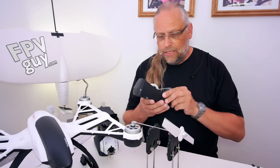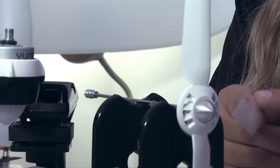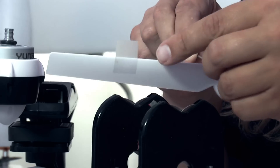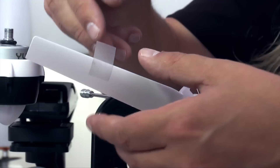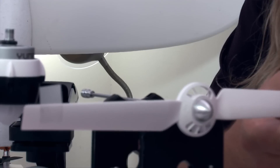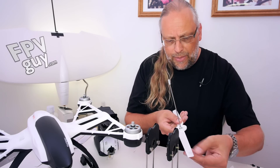I've attached the propeller to the stick and put it on the Dubrow balancer — and there is no doubt this thing is unbalanced. So I'm gonna grab a little piece of tape. This propeller is really quite unbalanced so I grabbed a piece about this big, put it up on the light side, and wrap it around. Let me see how that did. It needs a little more, so I'll release it and move the tape further out. That's pretty good, so we're gonna finish this up by wrapping the tape around.